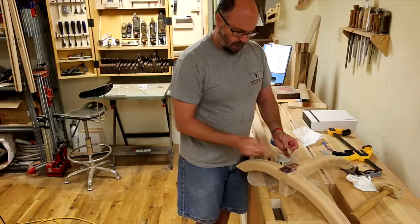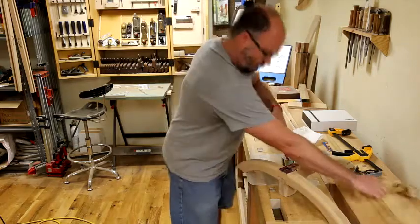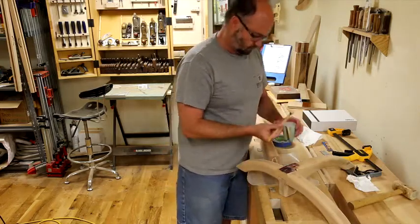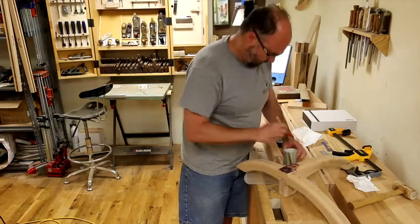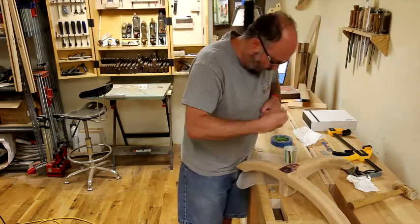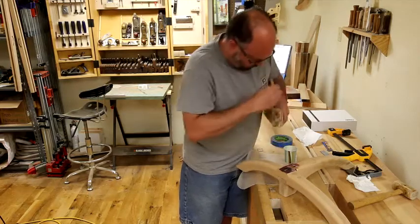When I bring the joint together, I've got wax paper underneath to protect the top of my workbench, and I've also got blue tape there that I use to create sort of a dam from underneath to keep this low-viscosity epoxy from flowing out and to keep it all within the joint. I just added more as I needed as it sunk down in.